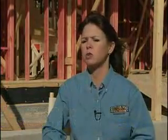Not only is it very strong, but it's a very dense material. And when you have dense wood, you have less tendency for things like nail popping to occur. So builders love to work with it. If you reduce the drywall nail pops, you reduce a lot of problems that the builders have to contend with during the framing process.